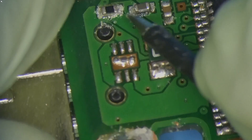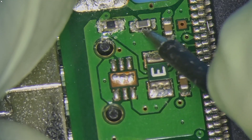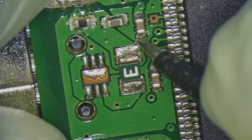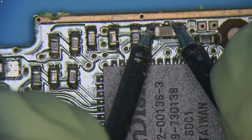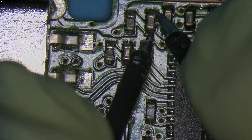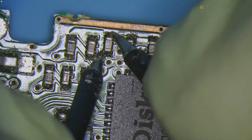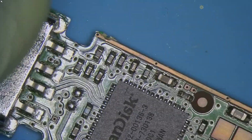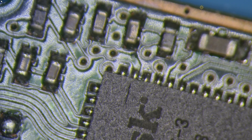We're not supposed to have that short. So we've got five volts coming in, going through this resistor, hitting this component — you get voltage here. Where does this go? So if we were to inject voltage to this line...